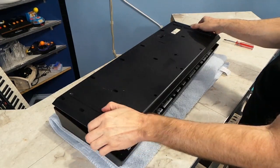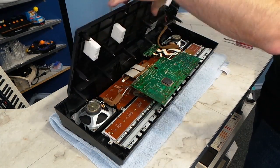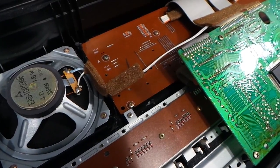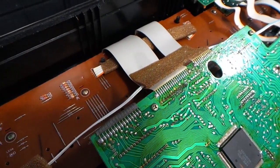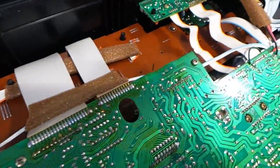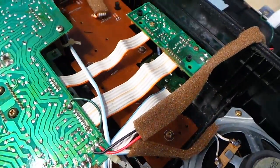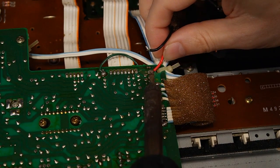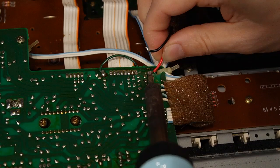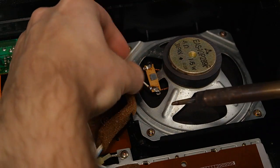So I got the bottom off. Looks like the battery cable is soldered on — how annoying. In fact, one of the more irritating things about Casio's keyboards is that they solder all of the ribbon cables and everything, which means I'll have to remove all of the boards together along with the speakers, because they're all soldered on as well. So I'm going to desolder these wires for the battery compartment, and I think I'll do the speakers too — they're easy to desolder and it'll make life easier.